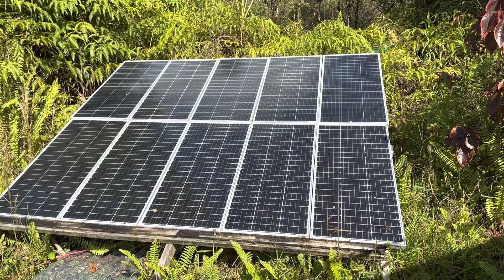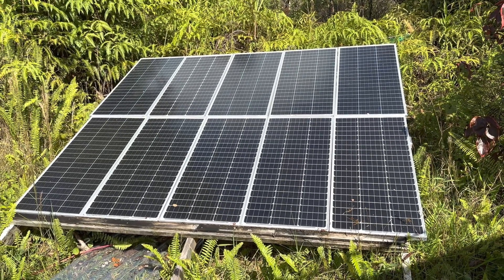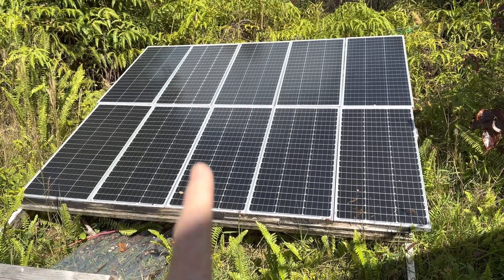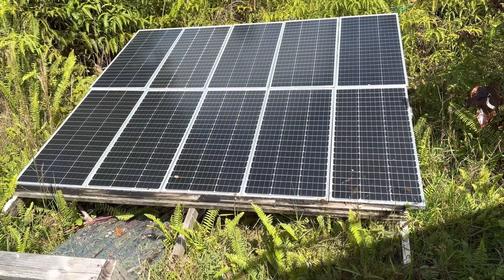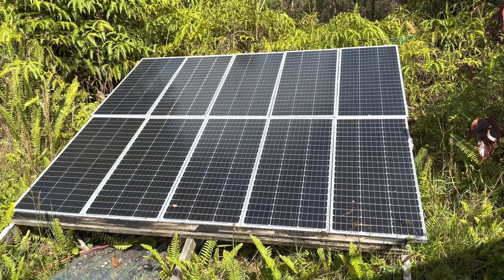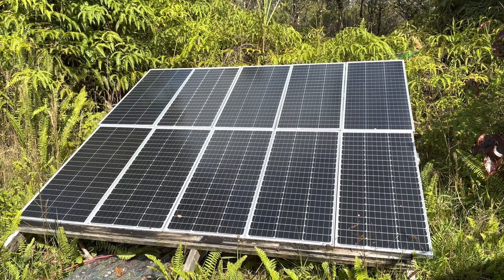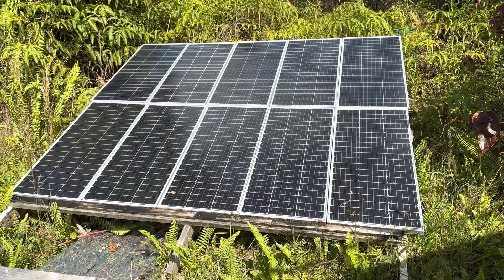Referring back to those Chins batteries, I've got 1,000 watts of solar tied into that 600 amp hour bank — I could add a lot more. The great thing about lithium iron phosphate is how fast they charge and how slowly they discharge. Those are 100 watt panels in two separate strings tied in series — a 500 watt string on the bottom and a 500 watt string on the top — going into two separate charge controllers. That gets the 600 amp hours to a pretty good charge most days. I may throw another 500 watts up there eventually, but with the short days of the year right now I'm doing fine.